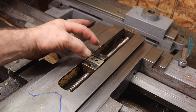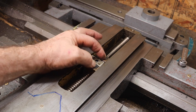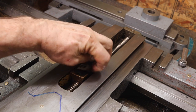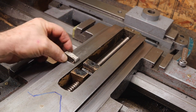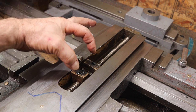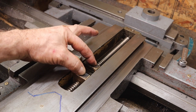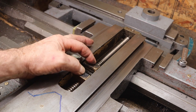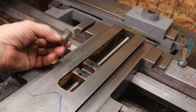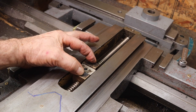These are the nuts. These two nuts here are threaded and they're really quite worn — I really need to replace all this. But the nice thing is it has this wedge here between these two nuts, and that's why there's three screws in the cross slide: the two screws for the nuts themselves to lock them in place, and then there's one that pushes down on this wedge.